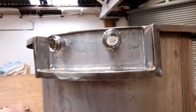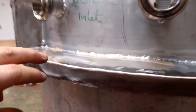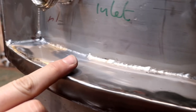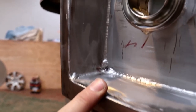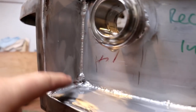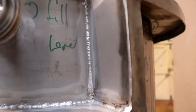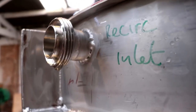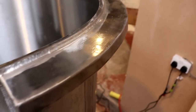You might be able to see now that we've rinsed off all of the pickling paste — just look at what the welds look like. Totally different — really nice and shiny. Apart from the odd spot of muck, that's all it is. They look really good, exactly the same colour as the steel, as they should be.